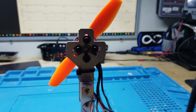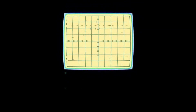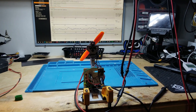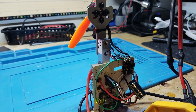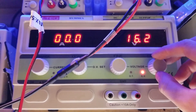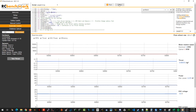I've set up my dynamometer and modified the code in my automated motor testing scripts to run various tests to determine if 6S is really the new 4S. The first test spins the motors up to a specified setpoint RPM, takes 50 measurements, and averages them together to calculate the efficiency of the motor at that RPM — so we can compare the differences between 4S and 6S voltages. We'll configure the power supply to output 4 volts per cell, since the only voltage sag will be the drop from the wiring: 16 volts for 4S. The RPM setpoint for this test is 12,000 RPM.